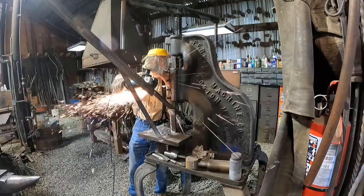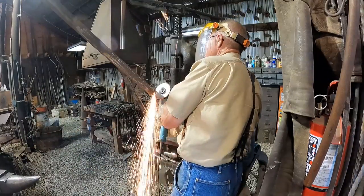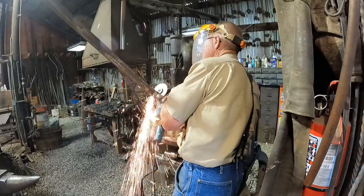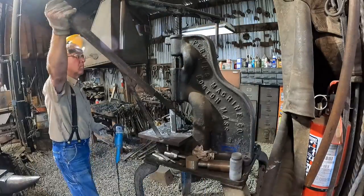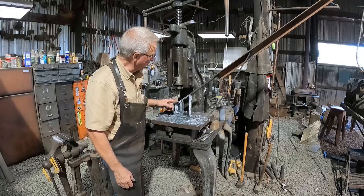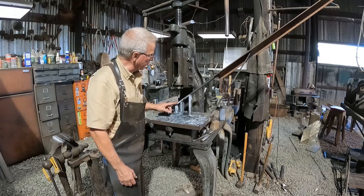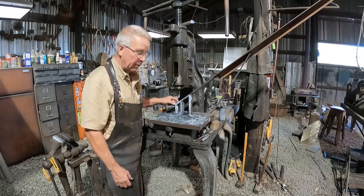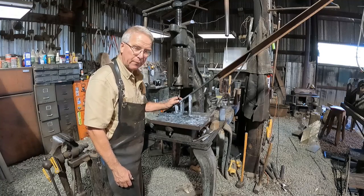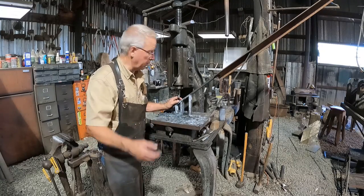But in the meantime, it's time to cut apart the ramp, the machine. Every machine you make is a prototype, and then you have to adjust it and tweak it. The only thing I would do differently on this, for those of you who might tackle this someday, is I would have brought these vertical supports probably under this lengthwise, because I got just a little bit of deflection right there, which I think sort of exaggerated the distortion in the piece as I would pull it out.